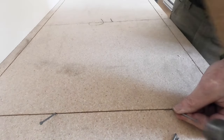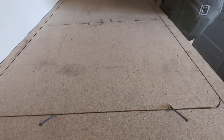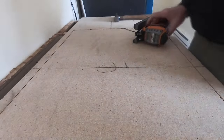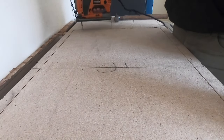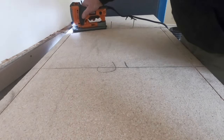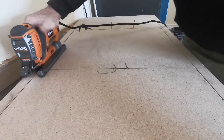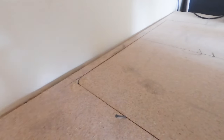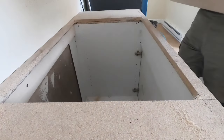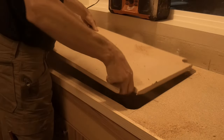Just don't grab it by the thin cuts near the edges. Before I cut the corners, I put in two nails on each side of the cutout, keeping them far enough away from the corners to get my saw in there. This helps keep that slab in place until I finish my cuts and keeps it from dropping down on the plumbing below. I have to make sure that I'm clear of the cabinet below. I haven't nailed this down yet, so I can slide it around a little as needed. Now I can lift out the cutout. Alternatively, you can use a hole saw to cut out the corners, and/or screws instead of nails.